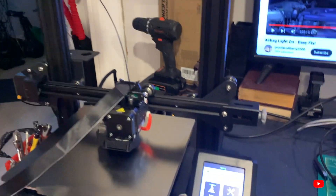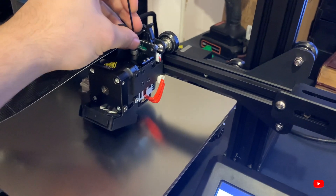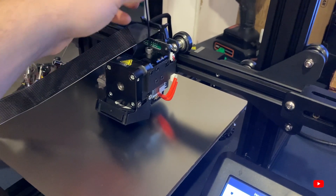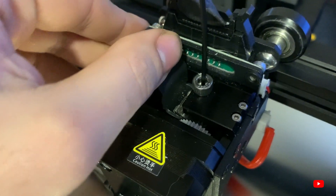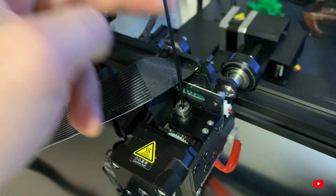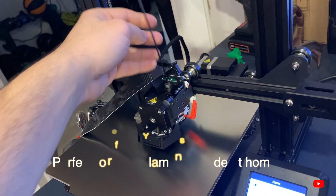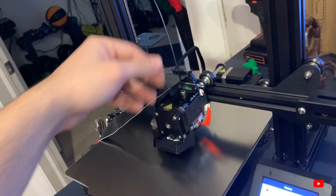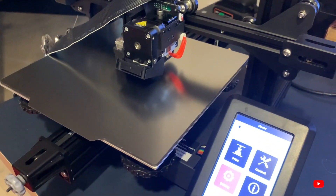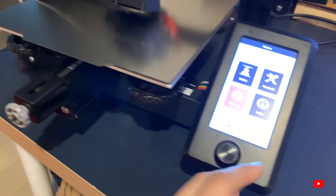Despite those issues, it really is a fabulous printer. The direct drive extruder is more lenient and prints nicer than Bowden setups — easier to dial in settings. It also has a wider filament path that accommodates slight variations in filament diameter, so you won't get filament stuck in a PTFE Bowden tube. This means it can potentially handle materials like polypropylene, polyethylene, or even home-recycled filament where factory diameter tolerances aren't guaranteed. For the price range, it doesn't get much better.